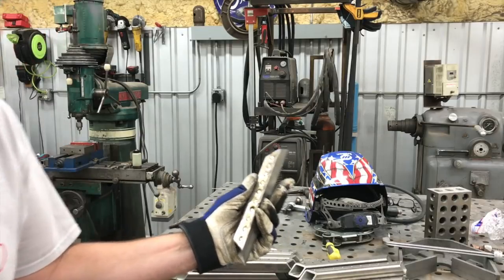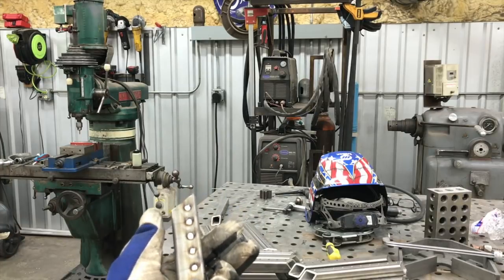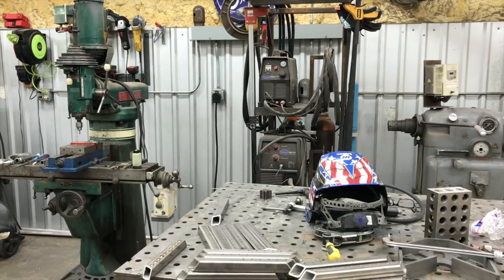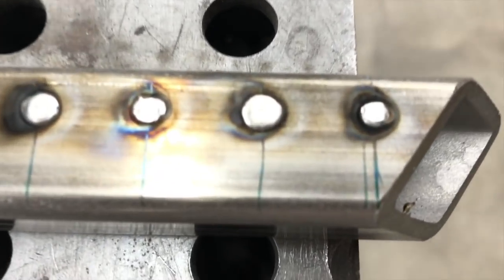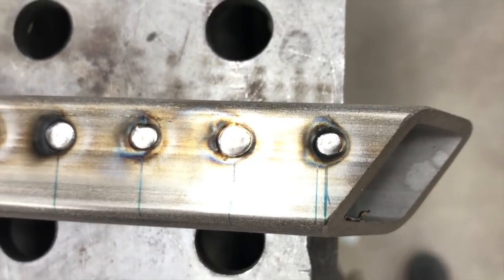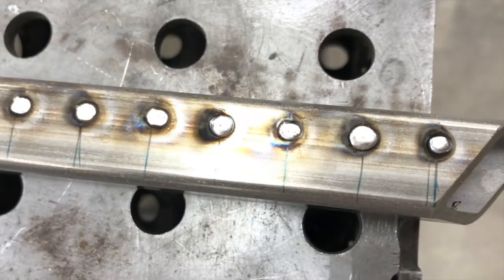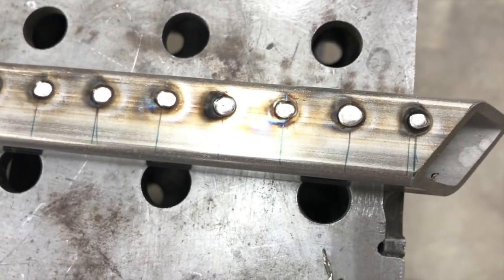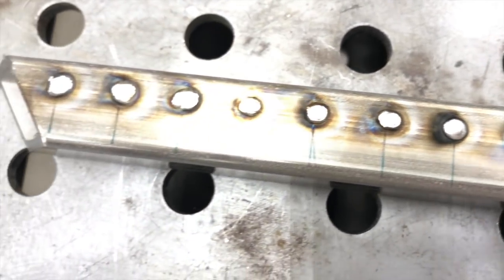There's a hole that's filled up with the Inconel 600 filler. Man, that's getting hot. As I finish up each hole, I taper off the pedal and dab just another little filler on top — you can see that sitting right on top of that one. I tried to keep them uniform at about the same size. Alright, let's show you the next step now.